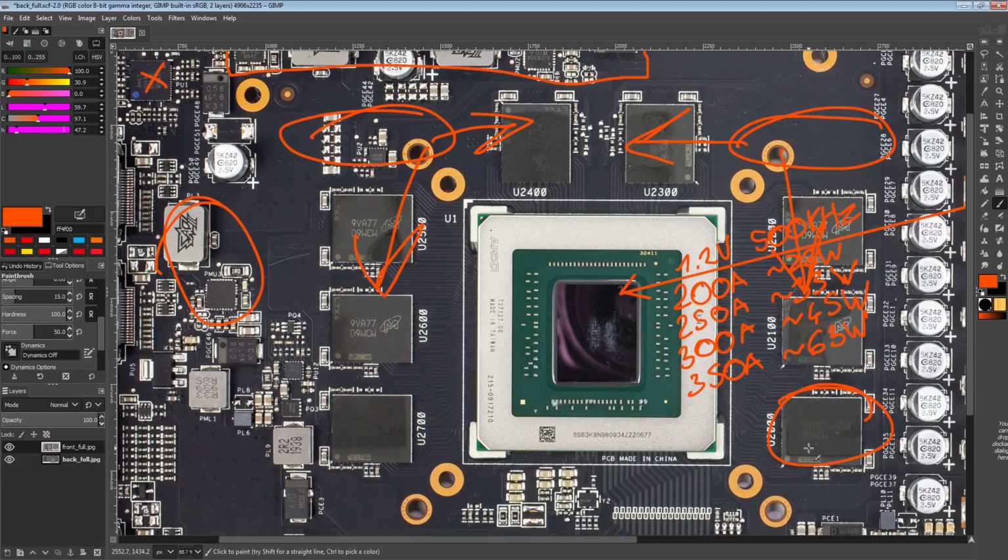So, like, one memory chip might be at, like, GDDR6 runs on 1.35 volts, I think. Or 1.2. I'm not sure right now. I don't really care. Either way, you could have one chip at 1.35 volts, and then the chip on the other side of the PCB, the chip furthest away from the actual memory VRM, might be sitting at like 1.3 volts, which is not ideal, especially if the chips actually scale with memory voltage. Then you have one chip that's getting 50 millivolts more than another chip, and the one getting 50 millivolts less is probably holding back your overall memory overclock.